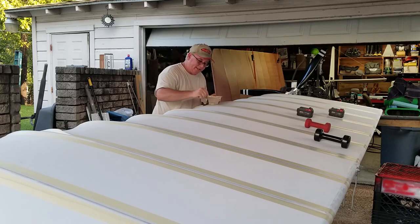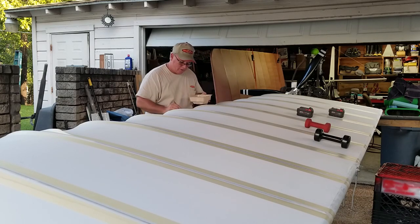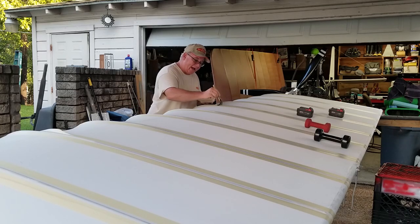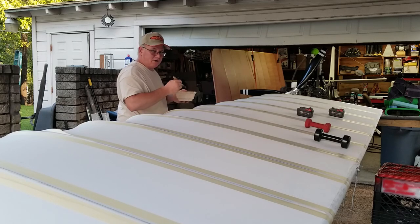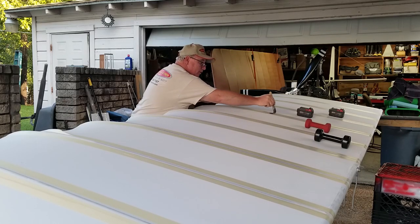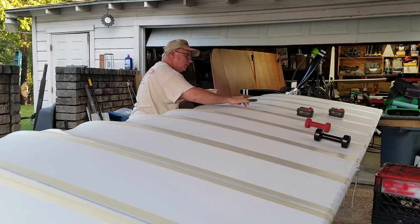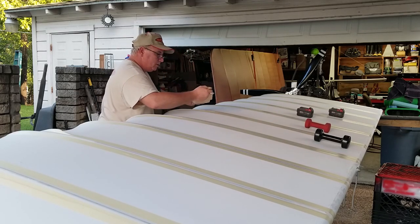So by increasing the thickness of this airfoil, I mean, it does increase drag. Fortunately, we have plenty of power on this plane. We're not looking to go super fast with it, but I do like the idea. If you've ever experienced an RC airplane that has an exaggerated airfoil thickness with a high horsepower power plant, short takeoff and landings are very easy.